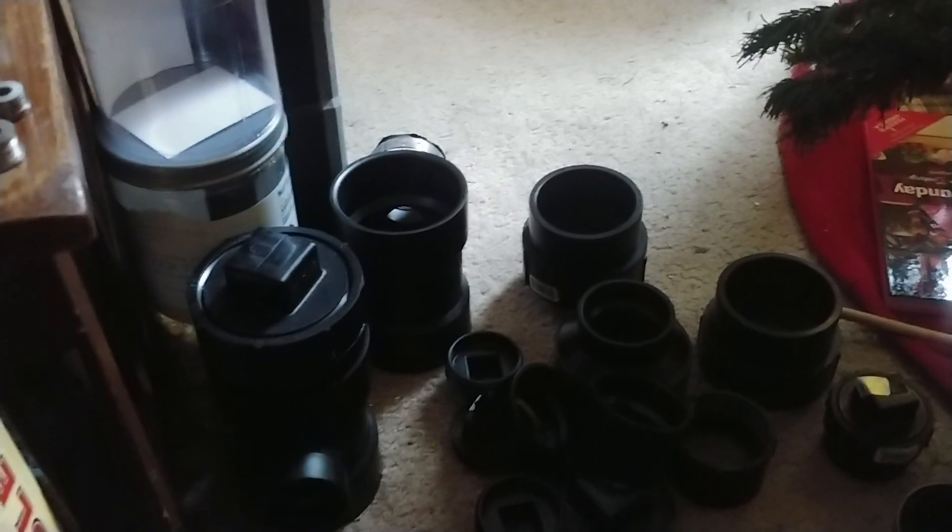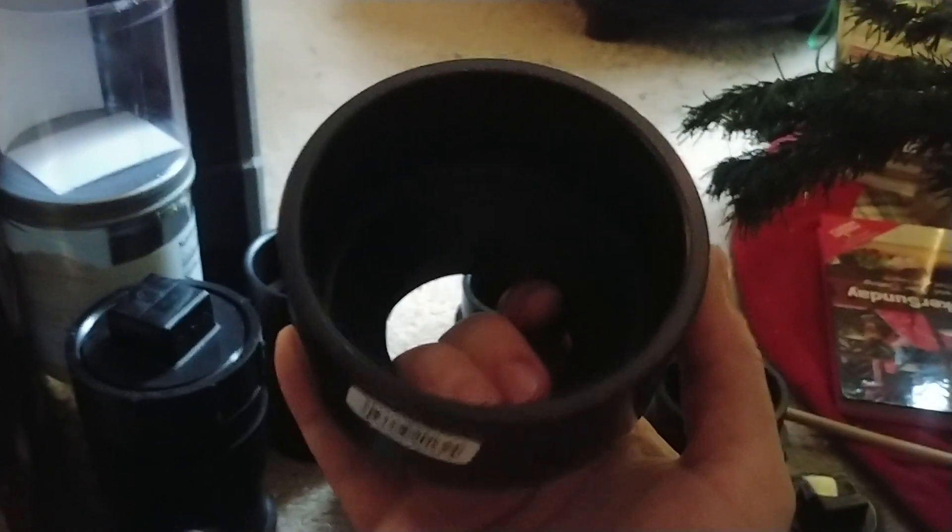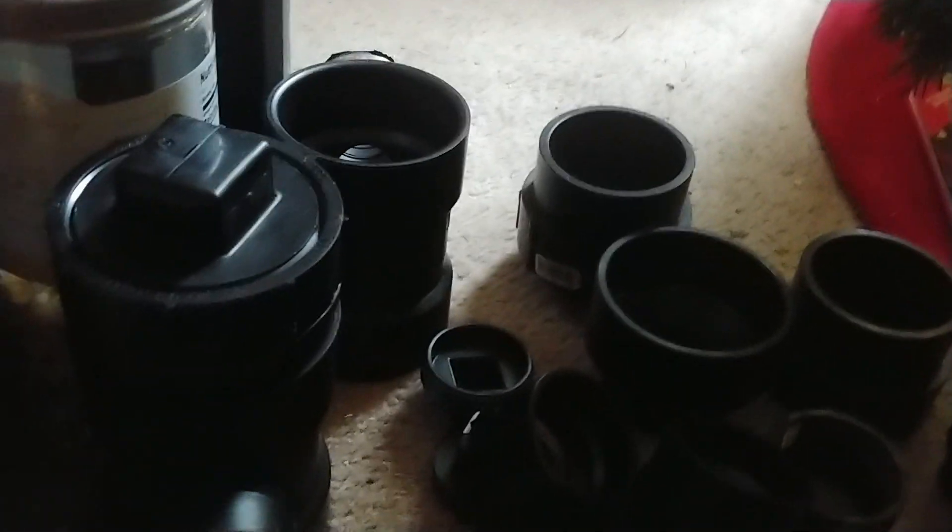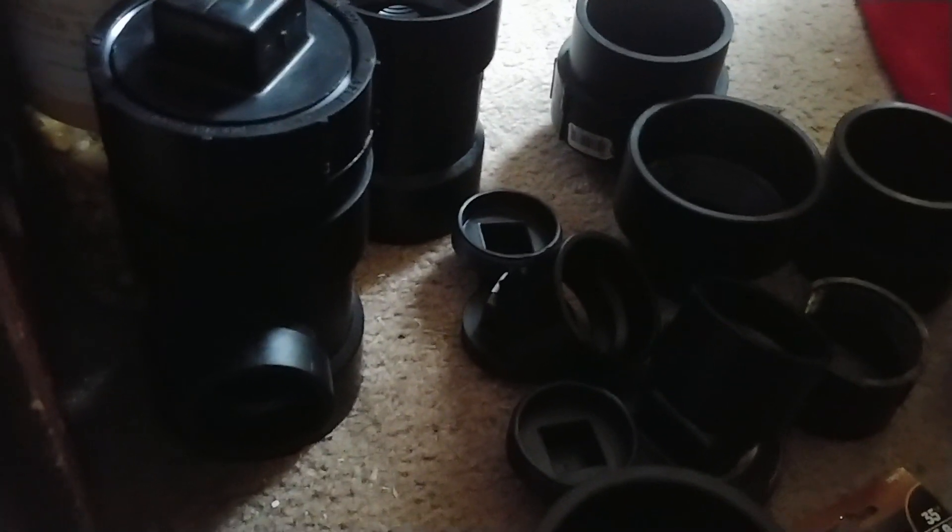There's gonna be a larger diameter center chamber that I can fill with water to maintain adequate pressure between the chambers delivering the oxygen and hydrogen feed. My original idea was a two-inch diameter tube connected to a three-inch diameter tube, and I could dump water and ice inside to maintain temperature so it doesn't melt the PVC. I may end up getting TEC coolers eventually to handle that.